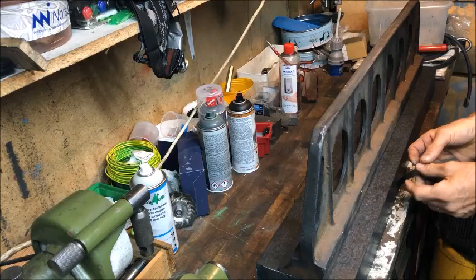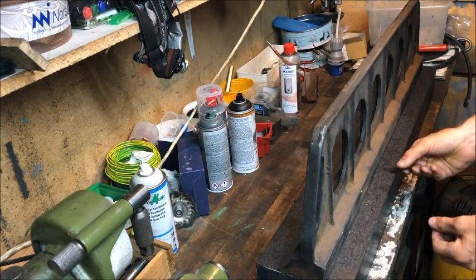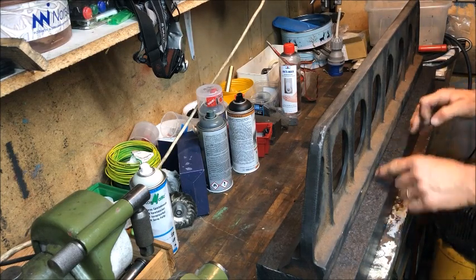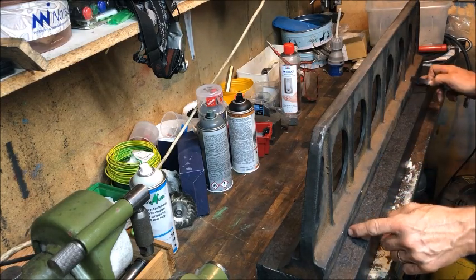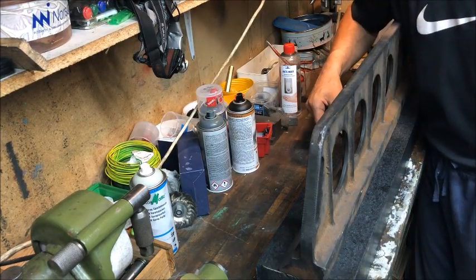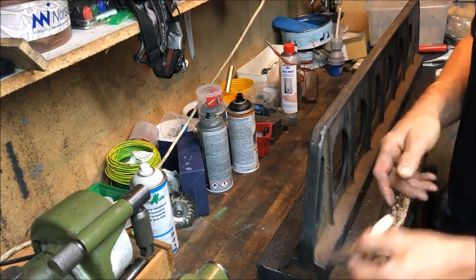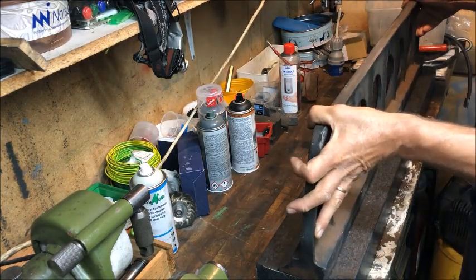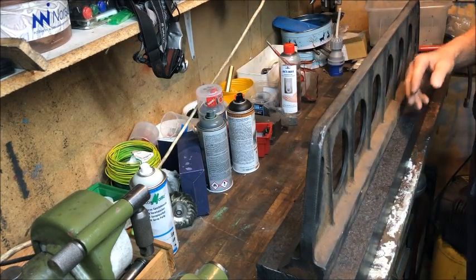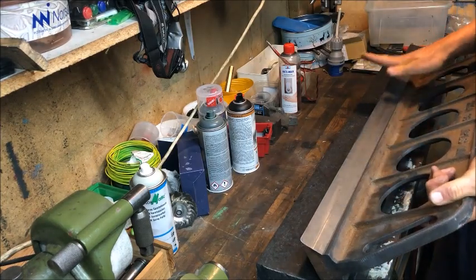It's four hundredths here just on one spot, but mainly it was like three, two, and zero. On the other side a little bit more, like five hundredths. I also saw that the non-plane surface was following the same curve, so this was actually a little bit high here.